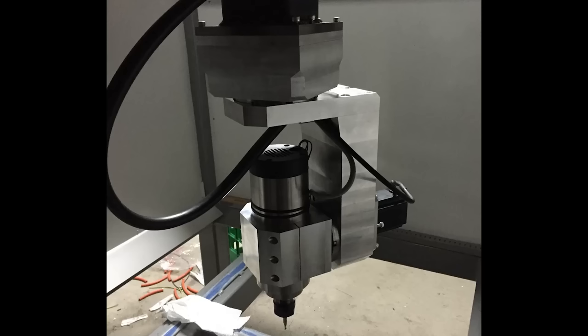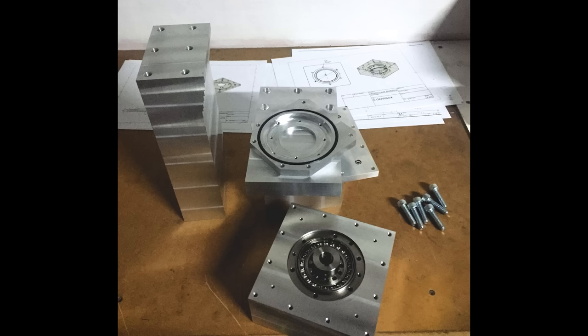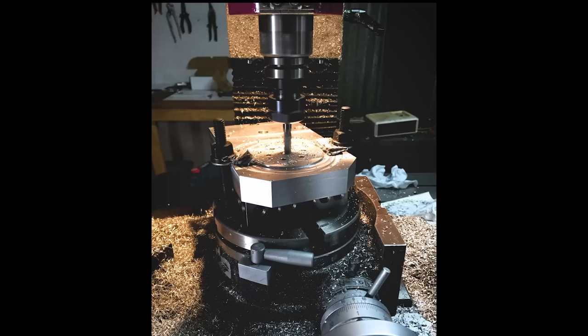The rotary axes — that's what everyone wants to hear about, and what I'm always being asked about. That was using a 120mm cross roller bearing on both axes. Both rotary axes are identical. They used an 80-20 sized harmonic drive, driven by a NEMA 23 stepper motor, but I think that motor was oversized — about half the torque would have done the job just fine. The chassis was aluminium, machined manually on this machine behind me, and that took about two months. I had to buy a rotary table, a vise — it cost me about $4,000 just to get the machinery to make this rotary head.